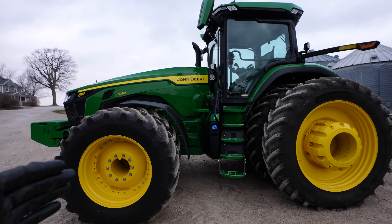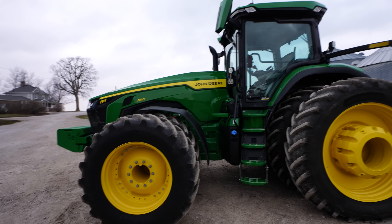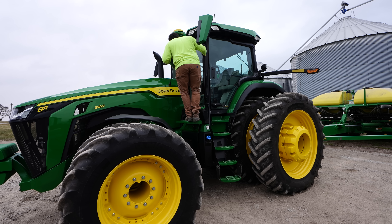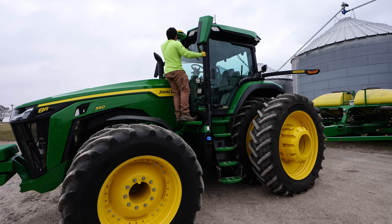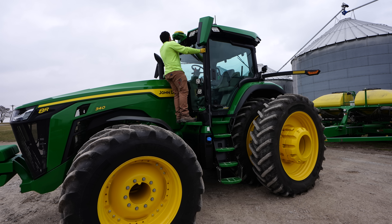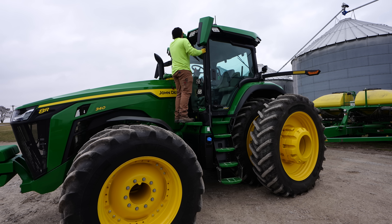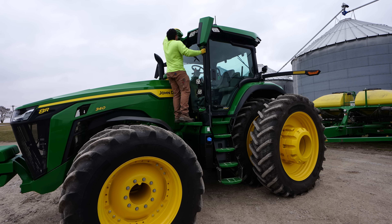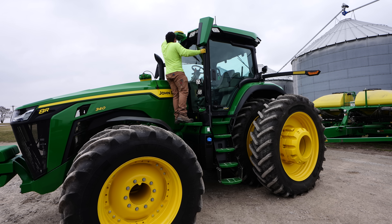The front duals I don't know if they'll have much of an impact but I'd like to think they would. The second upgrade for this planter tractor is switching to the 7000 receivers. The reason I'm switching these now is that this one has an RTK activation and the one that's on the tractor does not. These receivers are supposed to be more accurate in general. Because of the SF RTK system, you don't have to switch towers — they're satellite-based rather than radio-based, so it automatically switches towers and maintains optimal accuracy. We only run RTK on the corn planter and the sprayer. I'm just not sure that paying a $1,500 RTK activation returns anything if you're not doing a precision pass. The nice thing about these 7000s is there's no additional hardware to run RTK — you just pay for the activation.